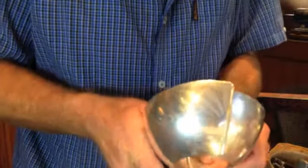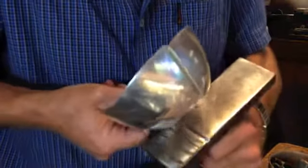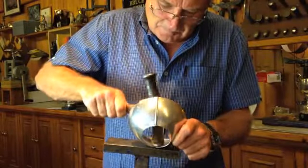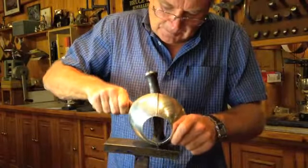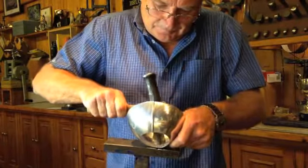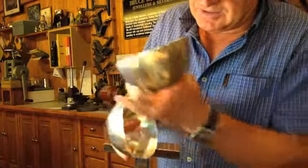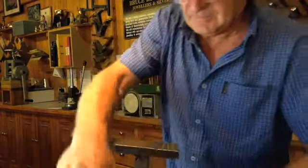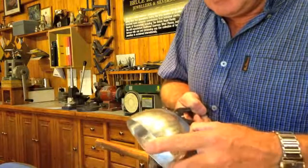Now the joints are all made, I can slide these together. And then I'm going to put them through a tool like this — again a piece of steel with a groove cut into it — and as the joint goes there, I'll use a hammer to squash the two sections together. Now we have the two halves of the milk can ready to trim up to get exactly level across the top. I'll put it on a stake and just get it completely round. And then you can see the milk can now coming together. With the handwork that's been done, there's just a tiny little bit of trimming just to the top to get the two 100% accurate.